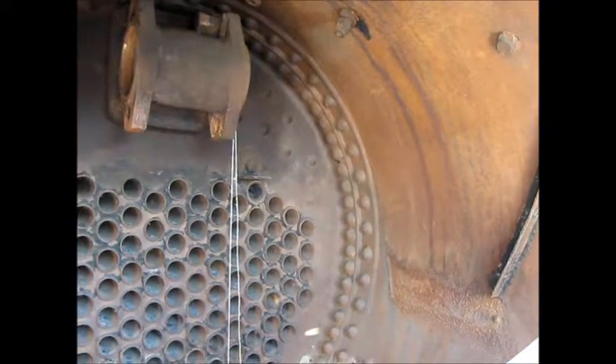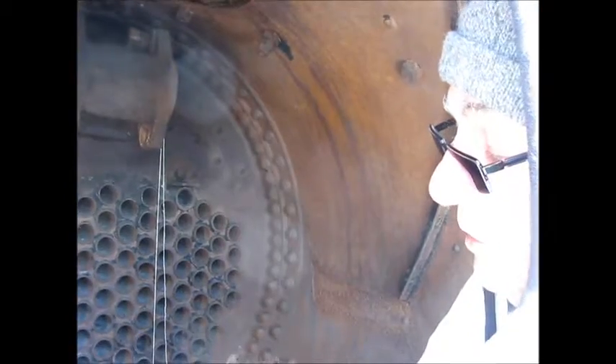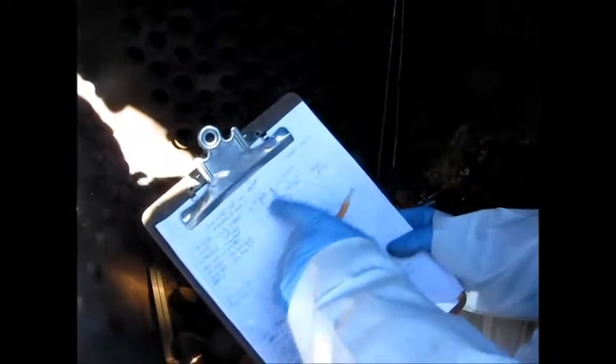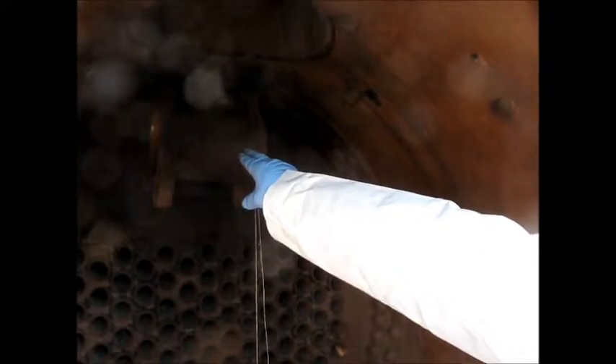Then you have this little pipe over here which is a steam blower line. Inside the cab, the engineer can adjust it for more or less. You're getting anywhere from 160 to 200 pounds of boiler pressure that comes out through this header pipe — your header housing actually. Then these are the header pipes which are the castings.